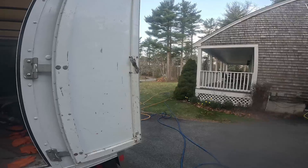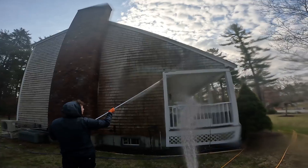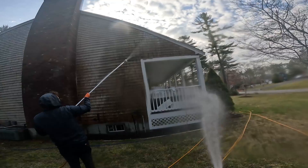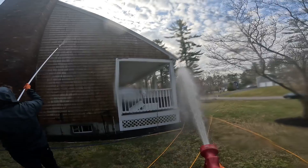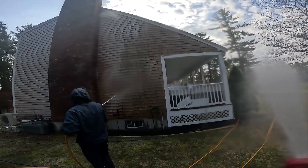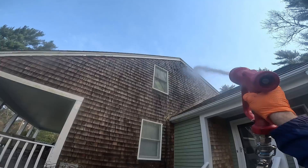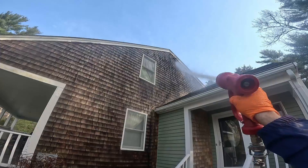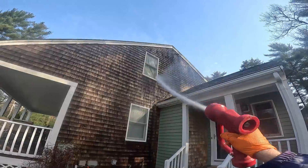Now let's get to it. Calum's got that six-foot aluminum soft wash wand with the J-Rod at the end. I'm watering down everything with this Goulds booster pump, hitting that deck and all that wicker furniture there. He's applying that chemical with little to no overspray because we've got that nice light wand on there. I'm just back on the right side of the house near the truck, pre-wetting all these cedar shingles before Calum comes through with the mix and starts to spray.